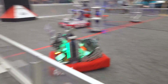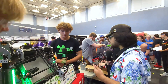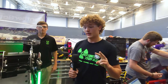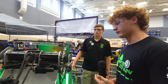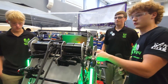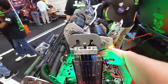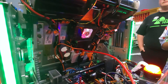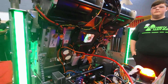Now I'll pass it over to Liam. Talk to me about your shooter — it seems pretty robust and angled. When constructing our shooter, we had two main objectives: one was robustness. We knew it would be a collision-filled season — we were a small frame perimeter bot going for quick cycles. That led us to developing a rack and pinion. We have two steel pinions on either side of the shooter plates, where each shooter plate is independent and the rack is integrated into that same quarter-inch aluminum plate. This meant we had virtually no issues during the season with our shooter.